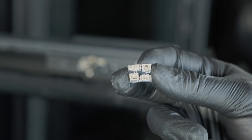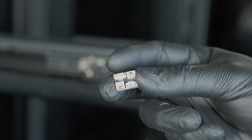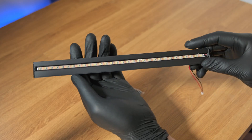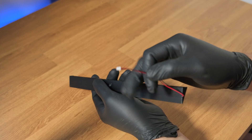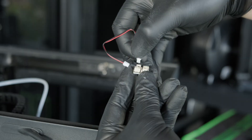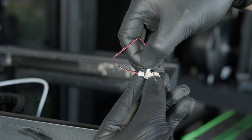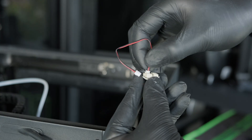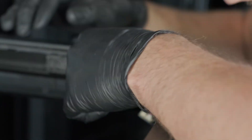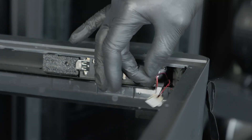Once that's done, remove the existing cable from this socket by gently pulling it out. This is the splitter we'll be using to connect everything together. Keep in mind that the pins are very small and delicate, so please be careful, and ensure you're putting the right cable into the right port. Also, this was originally designed to use both lights simultaneously, however it is now recommended to only connect one light at a time, as having both on can cause issues with your printer. This cable has a different connection type on each end — one with a clip, one without. Place the connector without the clip into the top left port as shown. Make sure it is oriented properly as it only fits in one way. Now place the cable from your new light into the bottom right of the splitter, then take the remaining cable and attach it to the circuit board of the printer — the same place where you disconnected the original light. Remove the blue plastic to expose the adhesive underneath and place it out of the way.